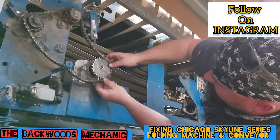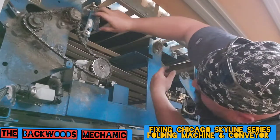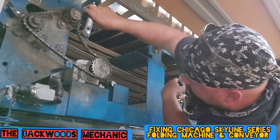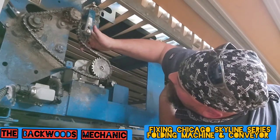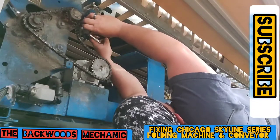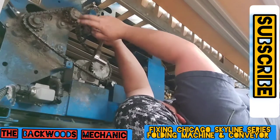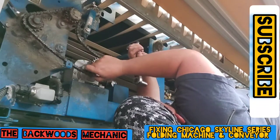This is going to be lined up — you want it to be fairly even. The chain is too long to begin with, this is just way too long. I got a chain breaker, we'll go grab it and cut it — real easy. These are supposed to provide tension back and forth. You can see right there it's got a spring, it's spring-loaded. Once you set that tension it should bounce back and forth. We might take a link out of that here later.